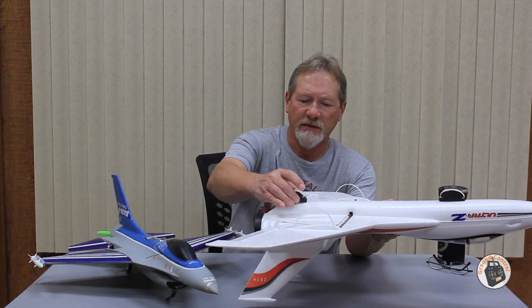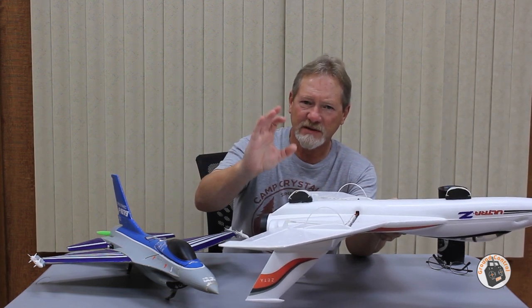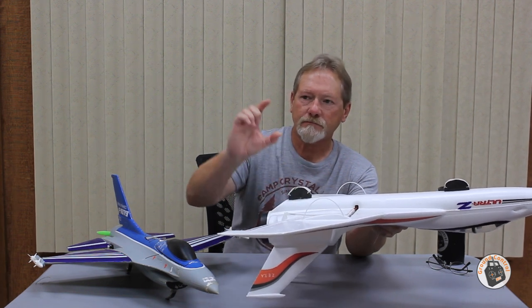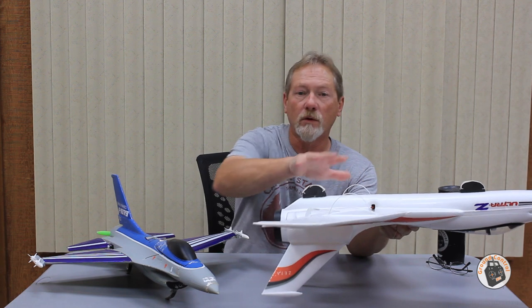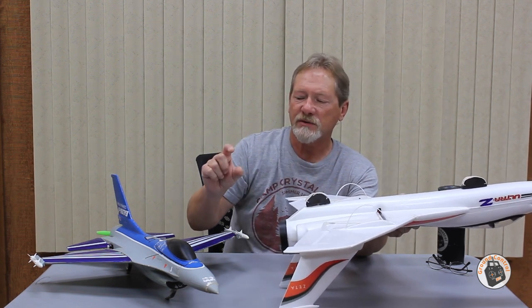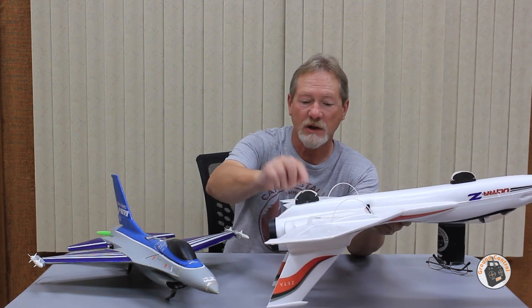The landing skid system has a very wide wing plate. What I decided to do was use some very dense foam — made out of transmitter stick protectors, those little donuts that sometimes come over the sticks of transmitters when they're packed. It's very dense foam, but it does provide some shock absorption. I took one of those, cut it in half, put the round part down, cut a half-moon shape out of those two parts, so out of one I could get four pieces.